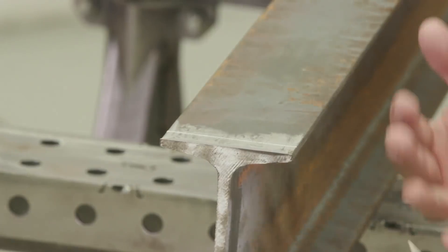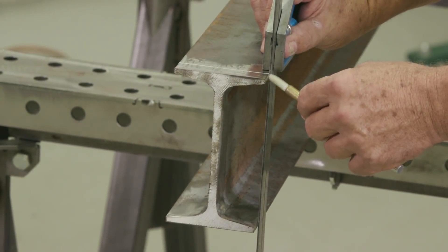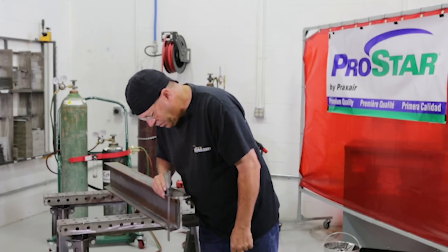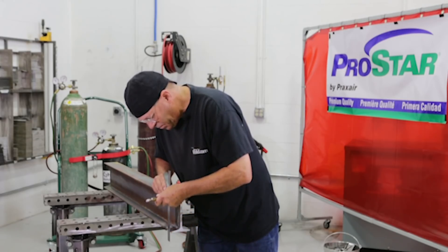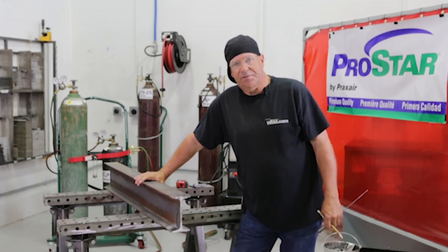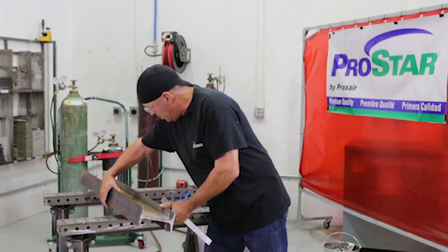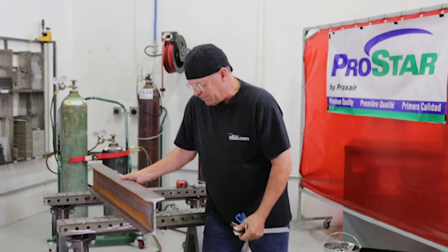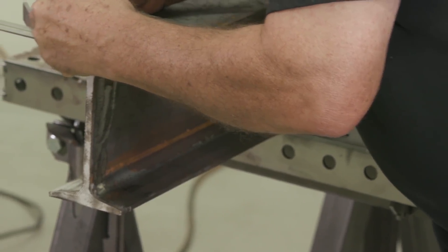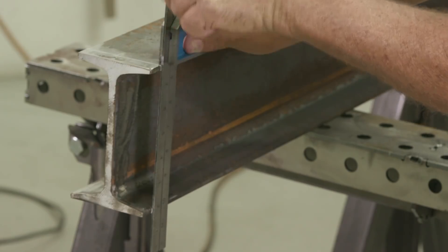I have that line drawn. I now need to project this all the way around the beam. The first thing I want to do is very accurately transfer this from the flanges to the bottom flange. I have the luxury of turning this on the sawhorses because it's a small section. There's a lot of times you're working with beams completely overhead or in a fixed position, but I can roll this around. I check these and they do line up — already transferred, so we're square.